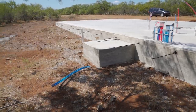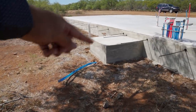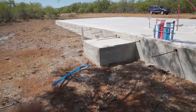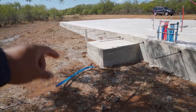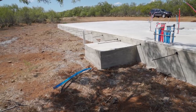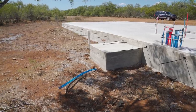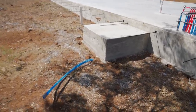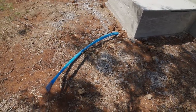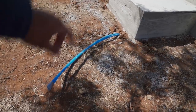These are the water lines. The well is going to be back there, so these are the water lines going into the house. The reason we have two is we have soft water and hard water. The soft water is going to the home and everything else — all the faucets outside the house and all the hose bibs — gets hard water. If you want them both to be hard, you can just put a wye right there and feed them one inlet, or you have the option to separate them.